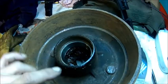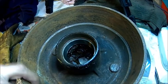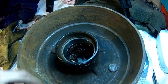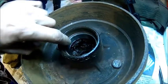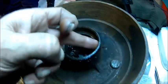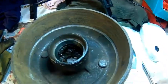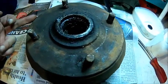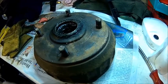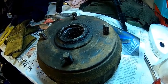We're on the last one, which was the one that didn't have any brake parts in it. It's very pitted here; I'll probably run through it with some sandpaper first. The next challenge is that the surface is a bit rusty, so it's hard to indicate. I think we'll indicate on the bearing race because that looks fairly okay. Also, someone's beaten that corner with a hammer quite badly, so it might be a challenge to chuck it up — that's the register. I'll clean it as best I can and we'll see how it runs.